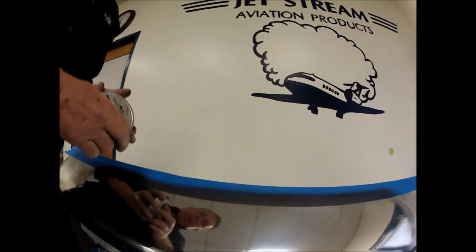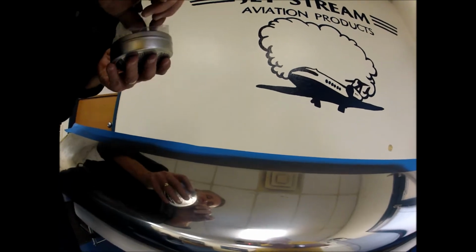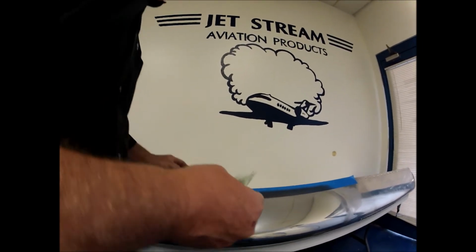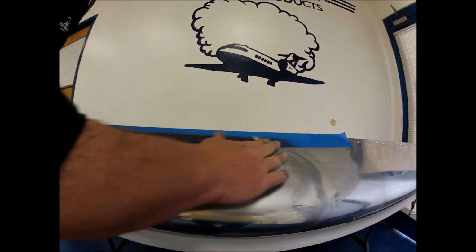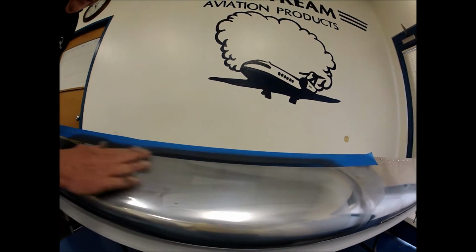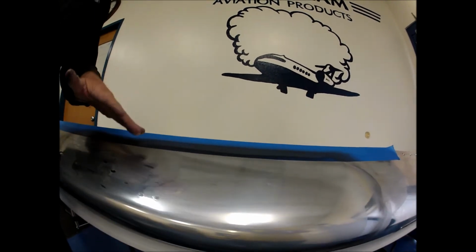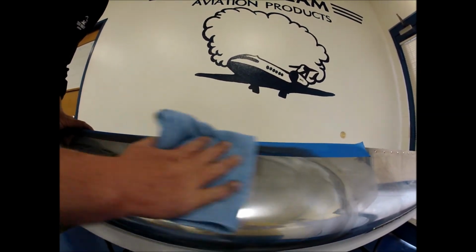Here's the Mirror Image. We're going to take out about a 1.5 inch piece and tear it off. It's surgical cotton with the polish embedded down into it. It's wet. Now we'll start applying this. We're just trying to apply the product to the surface right now. We don't cut with the cotton. We actually go to a microfiber towel. We want to work this product while it's wet. You don't want it to dry because it doesn't cut at that point.